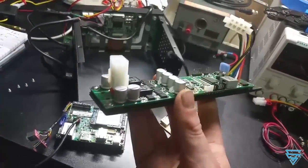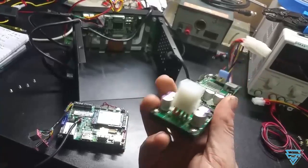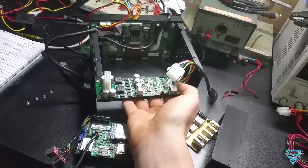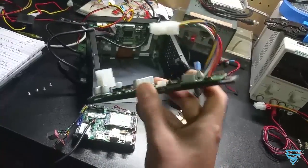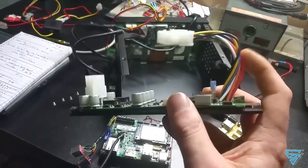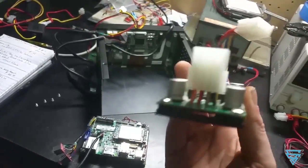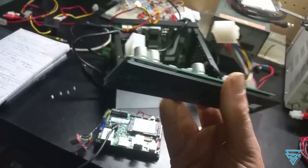The one major modification I made to this, which will definitely void your warranty, is you'll see these wires hanging off. This thing originally came with a plug, so you plug it in from either side, and with the width constraints in here, being able to plug it in from the side was not going to happen. I needed to be able to plug in from the top. I was unable to find any of those Molex connectors that came straight up like this, so good old Fry's, I went to buy some of these cables, which are pretty much meant for high-end graphics cards. Graphics cards? Is that what they're for? Yeah. Anyways, you can find them in the PC section. And then I cut those really short and soldered them in and left these extensions along. This is the one that actually comes out the back for powering the whole unit.